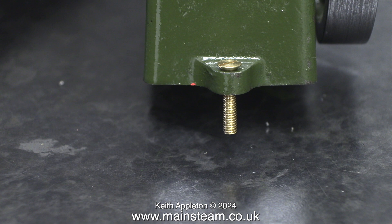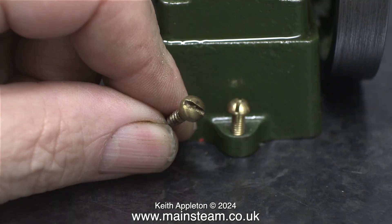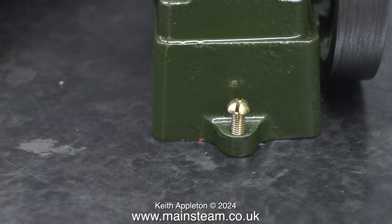This is a countersunk 4BA bolt — not what I'm going to be using as-is. I intend to machine the heads off two of these bolts and in place of the bolt head I will Loctite a brass nut in place. This will look a lot better. I think for the engine it's far better than either a wood screw or a dome headed bolt, although I think it's a good idea to provide both types of fixings so the owner of the plant can decide which type to use.